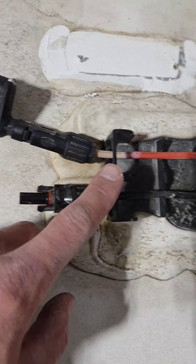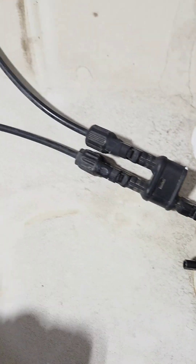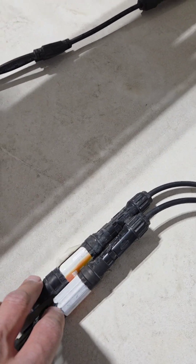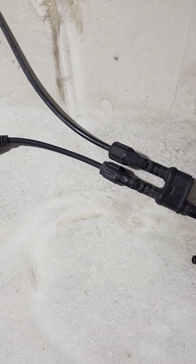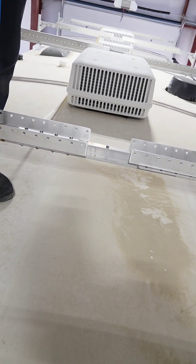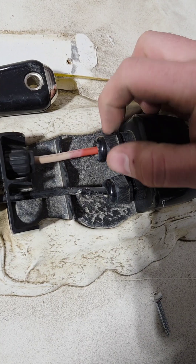Here's the red wire coming up with a parallel join down the line, a second parallel join right here — so two panels joining two panels, all leading into this one wire. At 10 amps a piece, you're pushing almost 40 amps through a 10 gauge wire however far down. There's something wrong with that.